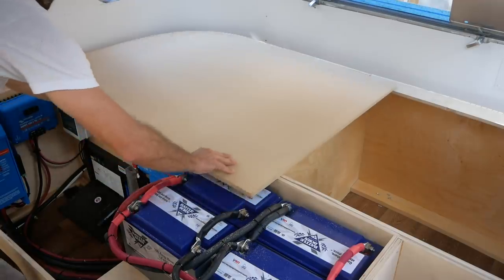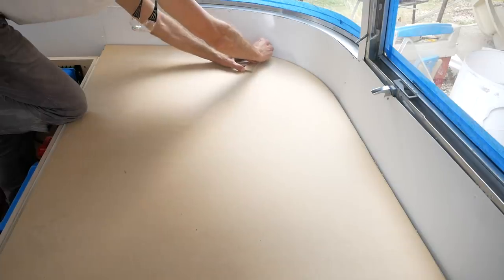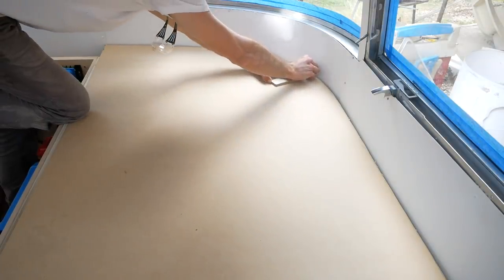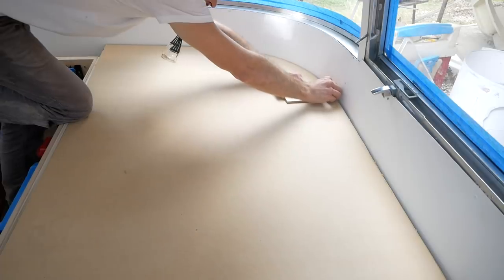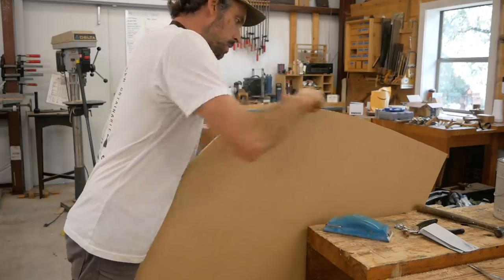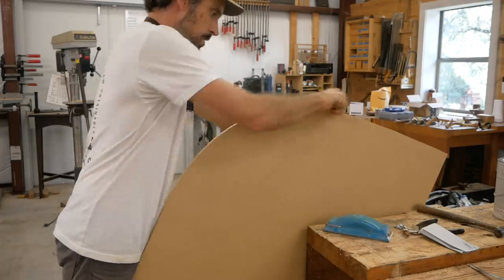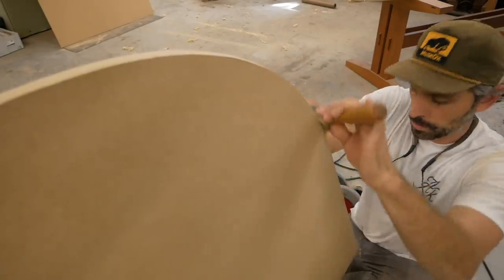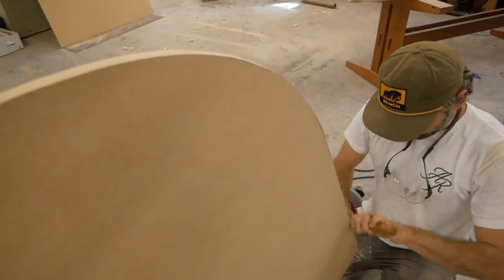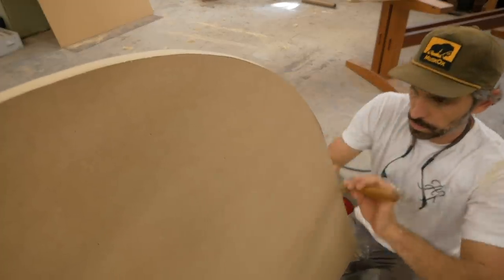You can see how it's getting closer — it's just hitting on that curve. This time around I've made a little scribe out of plywood with a point to it and the hole is about a quarter inch from the point, so it's right on that edge. The scribe's gotten a lot closer at this point. I'm not going to be able to use the jigsaw so I bust out my spokeshave and hand-shave it to that line. Yes, you can use hand tools on MDF and plywood — it's not going to hurt your tools. I did this process about four or five times back and forth so it took a little bit of time.